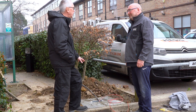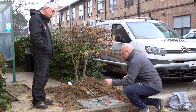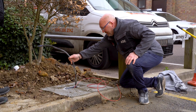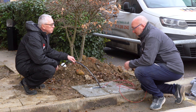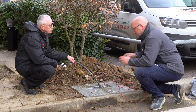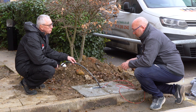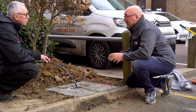Karl, I noticed that you've got one prepared earlier. Just like to talk us through what's happening here? Well, as we showed you on the previous one, the shuttering has now been removed and we've now got a very big, heavy, solid concrete base that's going to take the weight of our EV charger. As you can see, the cabling is coming out of the routing kit and the facility to plug the charger directly into your structure of cabling in your office, so that when guests arrive they can charge their car and they can be charged for charging their car. In total, we try and put, as you can see by the size of the block, probably 0.75 to 0.8 of a cubic metre of concrete in. You want to leave it for two or three days to cure to make sure that it's good, solid and cured.